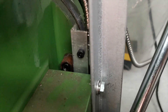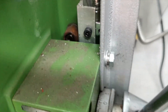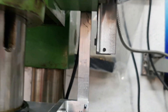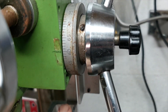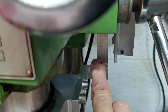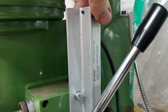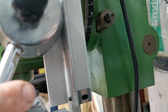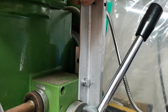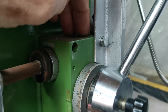The strongest bit of material to do the job, running up the back of the gearbox for the spindle adjustment. As you can see, there's not a lot of room — that grub screw just clears top and bottom. Then this single bolt with the locating pin down here works really well. It's solid, it doesn't go anywhere. And then this is long enough to go all the way through to replace the allen bolt that was in there before.